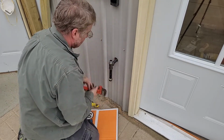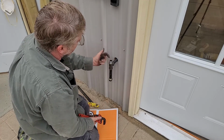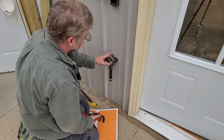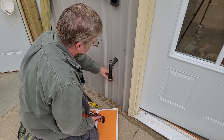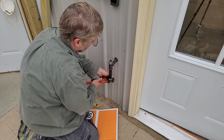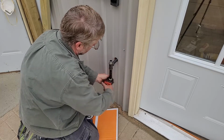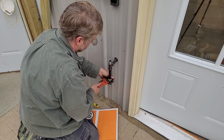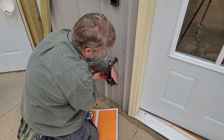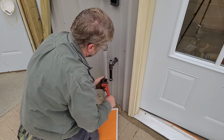And this is the drip leg. Gas comes through here and turns, and if there's any particles or any junk in it, especially if you ever get into this sealer in there, the pipe dope, it's heavier, so it'll fall out and drop in this drip leg. And every 200-300 years, you take this end piece off and clean it out. Which means never, because I've never done it. Imagine if you have enough crap in your gas to fill that 6-inch drip leg up. You got a lot of problems.